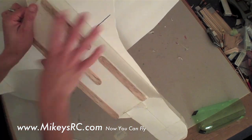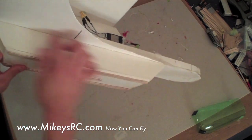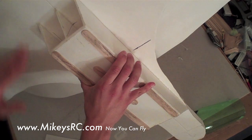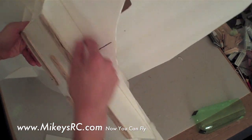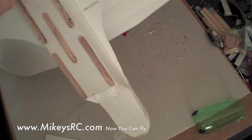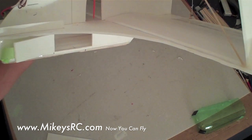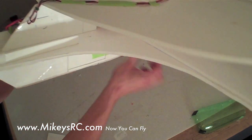After constructing the battery tray, glue it onto the bottom of the airplane using plenty of glue — lay a nice big heavy bead on top of this piece, stick it onto the bottom, lining it up with the marks on the plans. After it cures, go back and force some more hot glue into the joint on either side so this battery tray does not come unglued. I also have an optional door mounted in the bottom of my battery tray — if you add that, make sure the door can still open and close as you're mounting the tray.